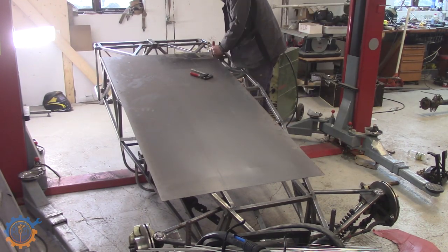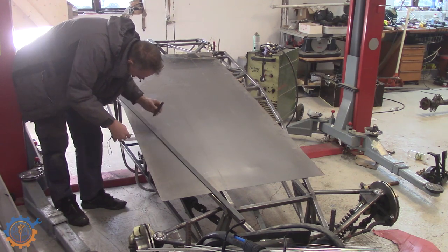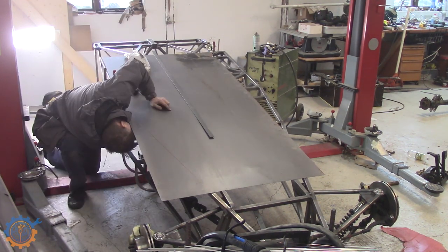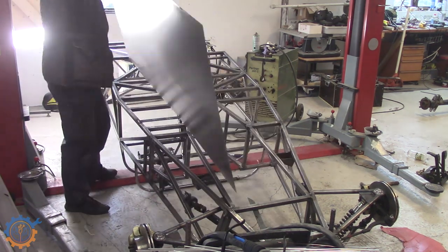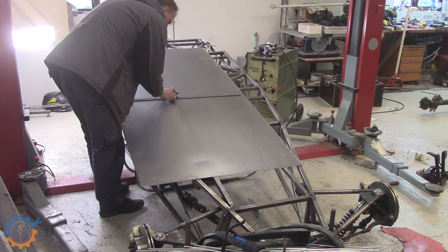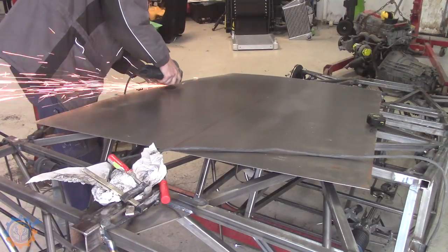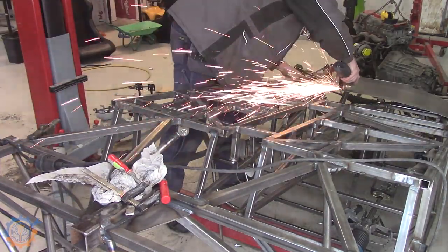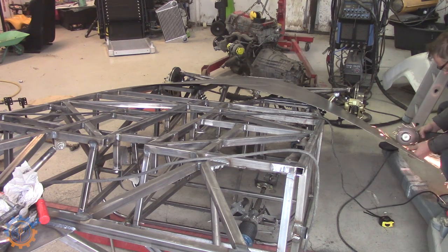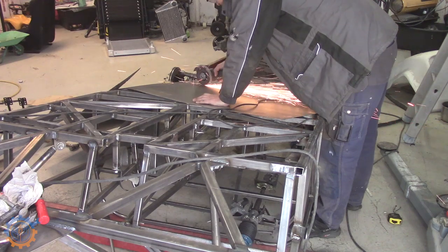So let's start with the sheeting. As I said earlier, I went with normal steel sheet because I had it laying around and it's simple to get in place. I started by marking on the top and realized it's really dirty, so I had to clean it up somewhat. It's a lot easier to mark on the underside, on the inside, so I'm doing that right now — flipping it over and drawing the lines between the different places. When all that's done there is a lot of angle grinding to do. Preferably I would have liked to cut this in a bigger machine or with a plasma cutter, but the angle grinder did a quite nice and quick job. Just make sure you have adequate safety gear on you.